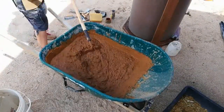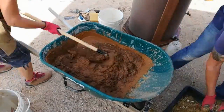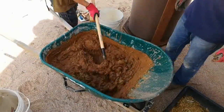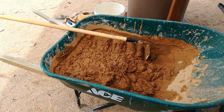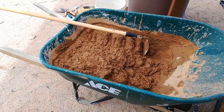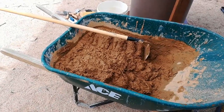We were patient, waited for it to dry completely, and the results were very good. Another thing that threw us was that the clay I had harvested from the wash was wet, and as a result did not absorb as much water as previous batches, so we found ourselves adding more material. We've got the recipe put together and it looked a little thin, so we gave it about 30-35 minutes to slake and firm up, and now we're going to put the first coat over the bricks exposed in the wall.